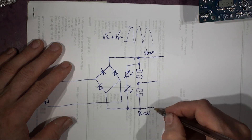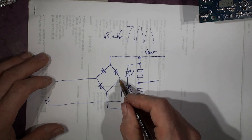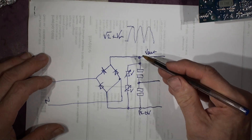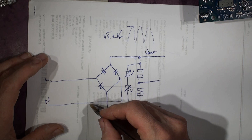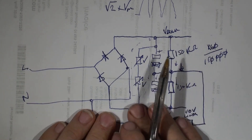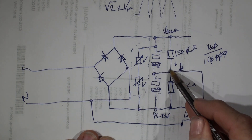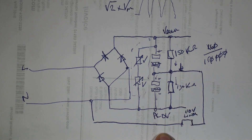To cut a long story short, on an AC mains situation, if you connect this point here to there, instead of the 240-volt mains rectified, you get a voltage-doubling circuit, which will charge one capacitor to peak and then charge the other in a half-wave type arrangement. So all that's needed is a link between the neutral and that point. On 110 volts, they have a link between the neutral via a solder link and the board tracking, connecting to that point, making a voltage doubler. In that configuration, this point is regulated by the mains power.